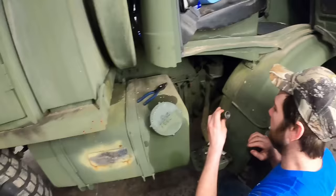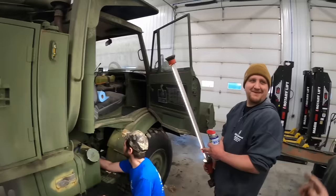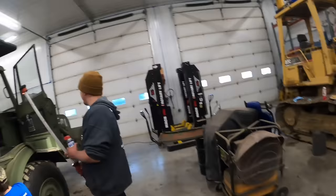It's gonna be like the water separator on one of my tractors. So that just unscrews out and you can clean it and put it back on. That one's really clean. It's a good sign so far. Now you've just got to go bleed it out again. It's your 13 millimeter.